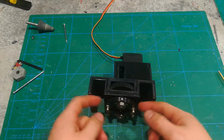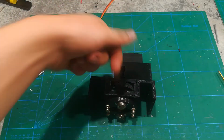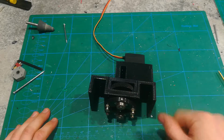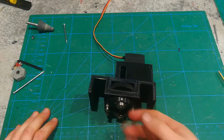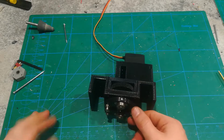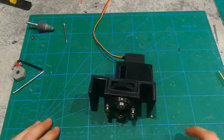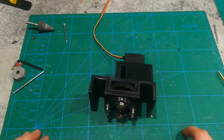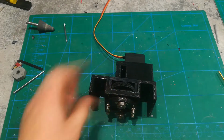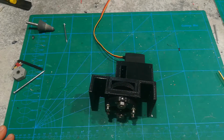Usually what you would have is you would have the servo directly on one of these, and then that would turn the other sets of these. But I've decided to go against that here because I decided to 3D print the linkages that go from here to the axles. And if I wanted to use these ball joints and 3D printed parts, there would be way too much slop in there, and that would just be really, really sloppy steering at the wheels. So I didn't want that. This is the best thing that I could come up with in reasonable time.